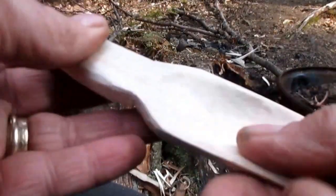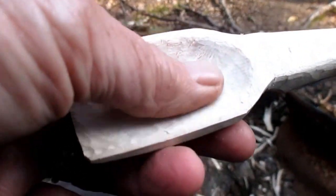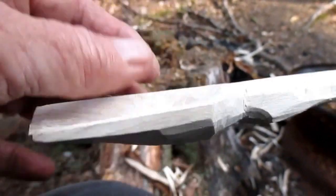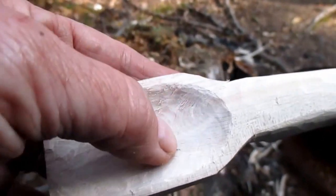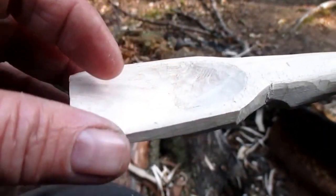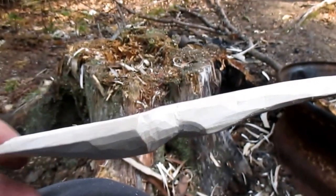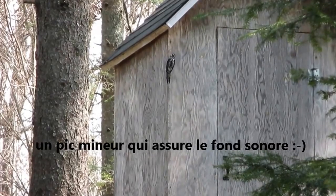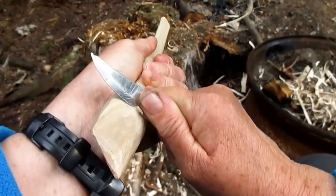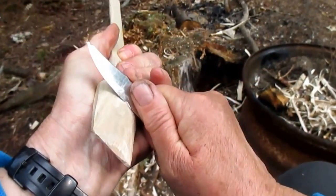Now I feel with my fingers to see if the thickness is roughly constant. There, the bottom of the spoon bowl is much thicker. I have the choice of removing from the outside or the inside. I think I'll remove a little bit here to make the hollow more round. Then I'll work the outside with the morin, which is more delicate than the gros couteau. I'll go with very small strokes, because here again, the grain can split.